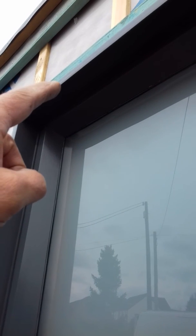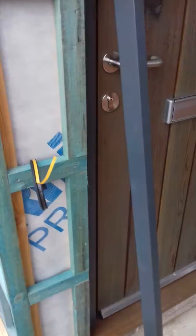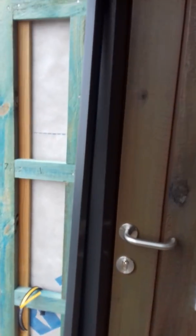That would then create a drip on the front, water will run off the building and then drip. What you don't want is a horizontal where it has the potential to then run across down the front of the window. Probably the easiest way, door and window trim, make it as a sub-assembly.